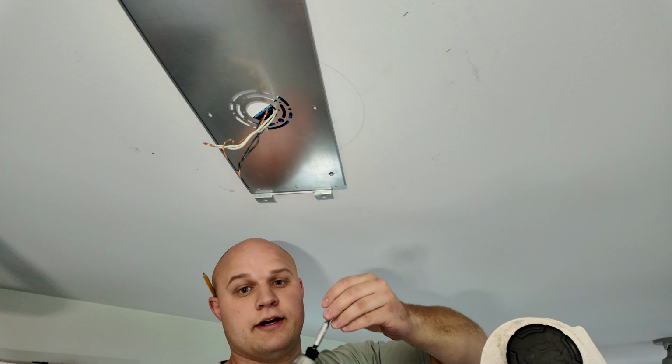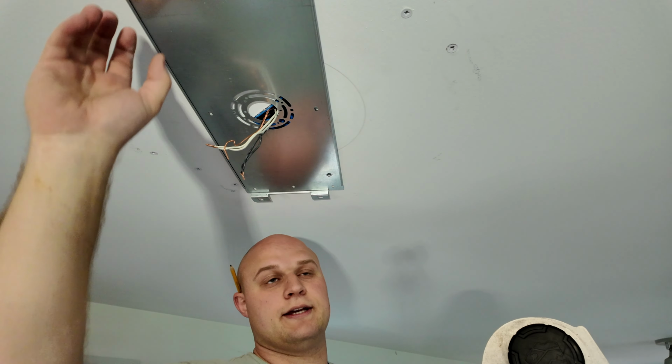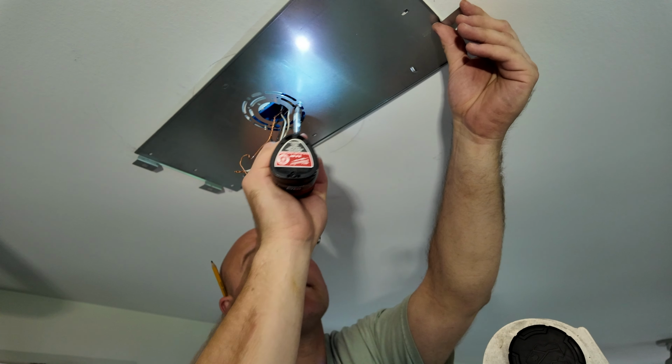So I got my drywall anchors, now I need to screw them in the 6 holes. Now that the 6 holes are drilled, slide the bracket back and mount it in place. So when it comes to hanging up the light now, it comes with these little hanging tabs, and all you need to do is clip them into each side.